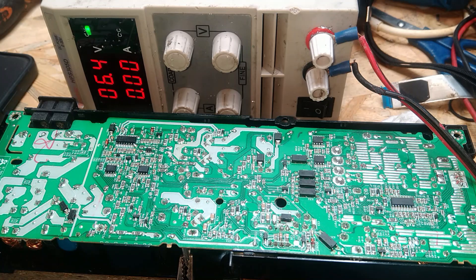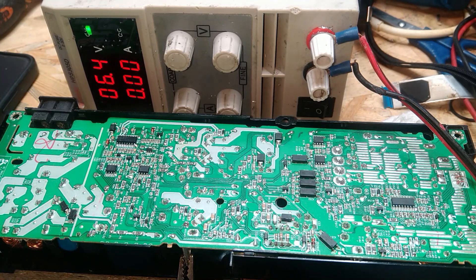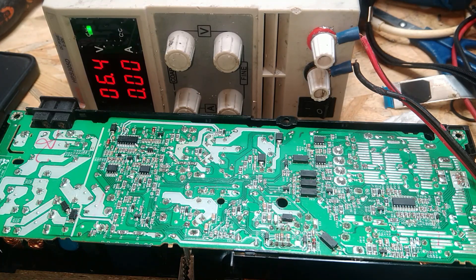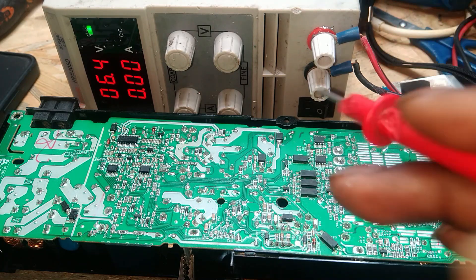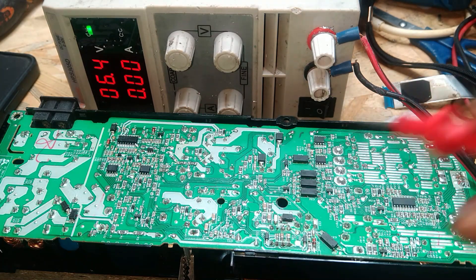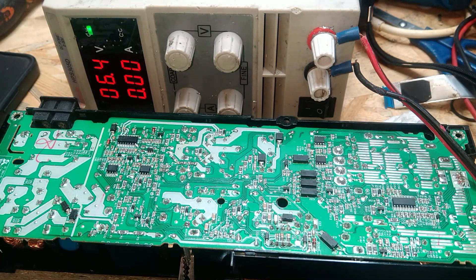Should I just replace it to prove it will work? That's the video. Hopefully it makes your lives easier. When you get this no-12-volt issue you can always test this chip, but sometimes there are other things like IC53 to check. If everything else looks okay, start with this chip — it will help you with the 12 volt issue. Thanks for watching, see you on the next one.